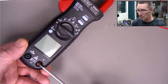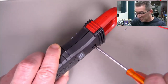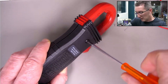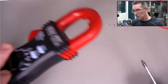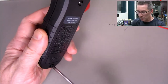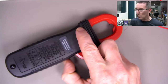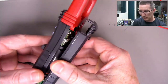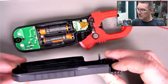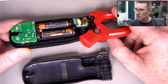It does have a high CAT rating - 300 volts CAT 4. As you'd expect with Brymen, they're pretty much the leaders in high CAT rated stuff. The screws have captive screws - nice. But the battery cover requires unscrewing the case - that's the first con. The threads are plastic self-tappers, deep down in there - not too terrific.